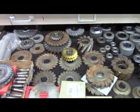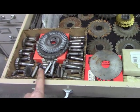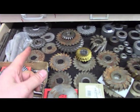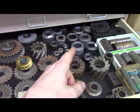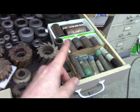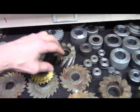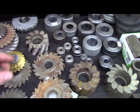Okay. These are horizontal mill cutters, right? Key seat cutters. I got stashed some reamers in there. I don't know. Those are ring gauges. Those are nice to set your ID calipers or bore mics or whatever. Arbor spacers and grinder. You know, and I bet you hear it. It's stuck, right? I mean, all these are like, you hear it, that click.